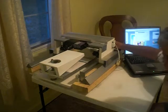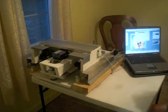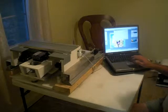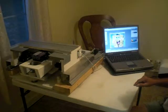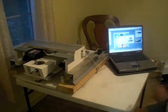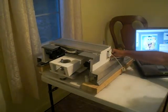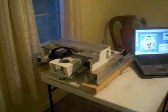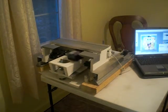That way my printer will ride right over the product that I'm fixing to put the image on. I'll run it all the way to the start point. I'm gonna go ahead and hit OK — it's gonna set the image and bring a window up. It's telling me the print cover is open because I left the cartridges out. All I gotta do is close that switch, hit continue, it's gonna set the image. I've got a drive knob here that I hold an eighth of an inch off. I let go and it starts to print. Give it maybe 30 seconds to a minute and it'll be finished.